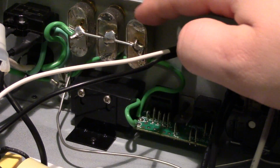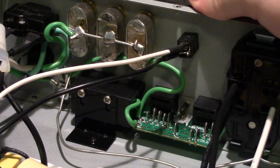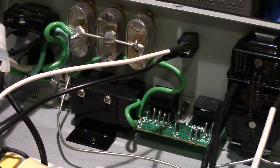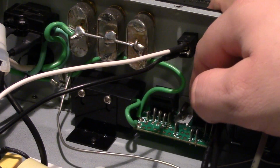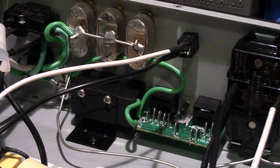The filter cans for the coaxial cable look like they're just ready-made modules, whereas the Ethernet one is just a bunch of diodes on one board, so I'm not really sure what that's doing. I think it's diodes. Yeah, they're all labeled diode. I know that these things usually don't work properly with gigabit Ethernet, which is kind of a pain. I remember I had my computer linked in through my UPS, and I was wondering why I couldn't get gigabit Ethernet speeds. It wasn't until I disconnected the UPS that it went back up and would sync at gigabit.